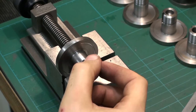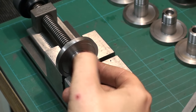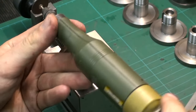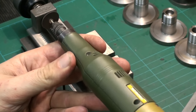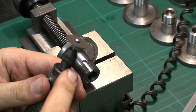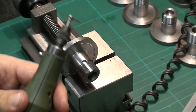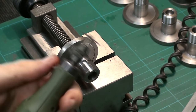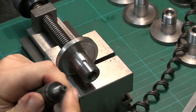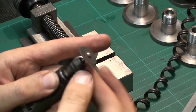Where I milled the slot into the adapters, of course I have a lot of burr thrown up into the thread, and the edges are super sharp. So I'm using my die grinder — a small Proxxon. I call it a die grinder but it's basically a Dremel without the power, though it's nice and compact. The collets are hardened steel, unlike Dremel collets which are made from pot metal. These are real ground hardened steel collets, so this thing is actually not that bad.